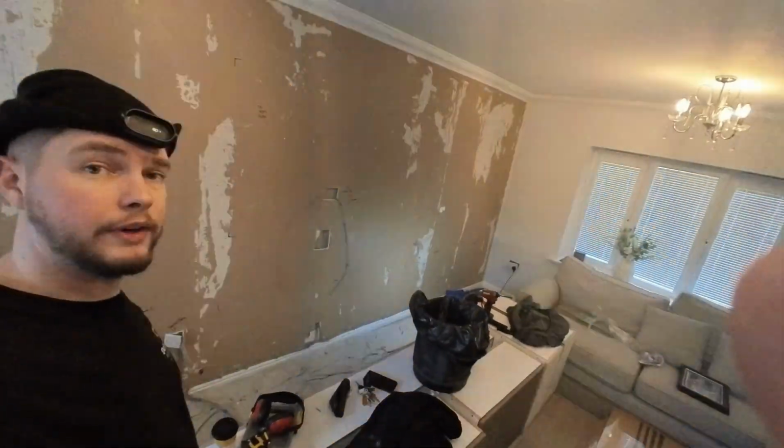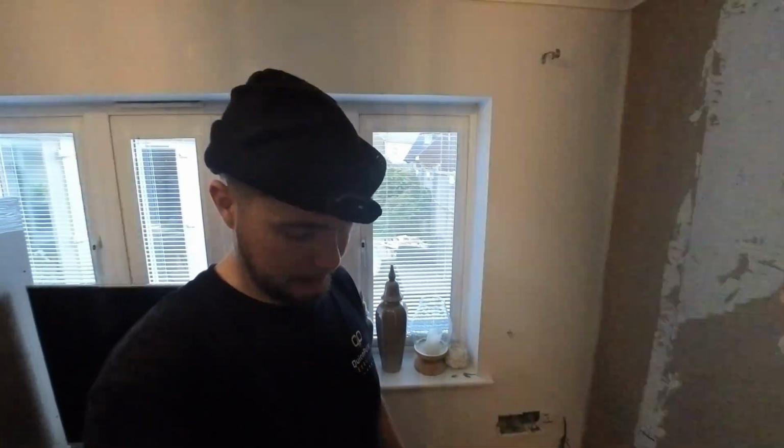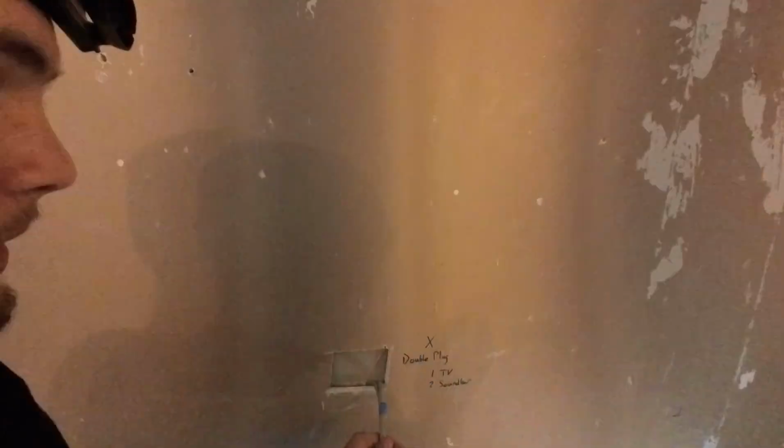That is essentially the first fix done. Cables are in. It's going to be a void behind the unit, so they'll come through, they'll be poked through. It's my friend doing it, so he knows the score. Then I'll put sockets in the cupboards when I come back. That one I haven't cut out because it's better leaving it like that. And when the acoustic panelling goes on, I'll cut it out, then I could put a box flush rather than it being really deep in the wall.